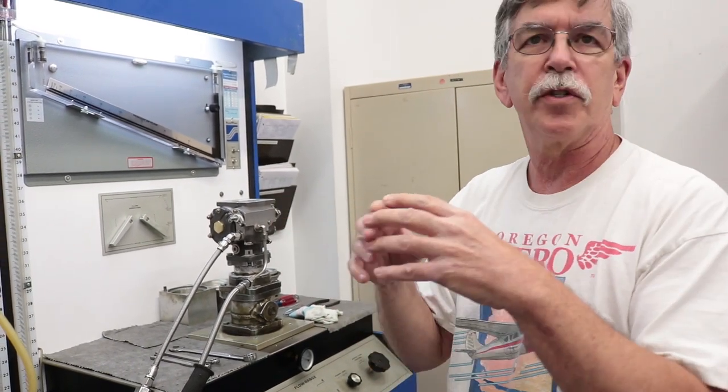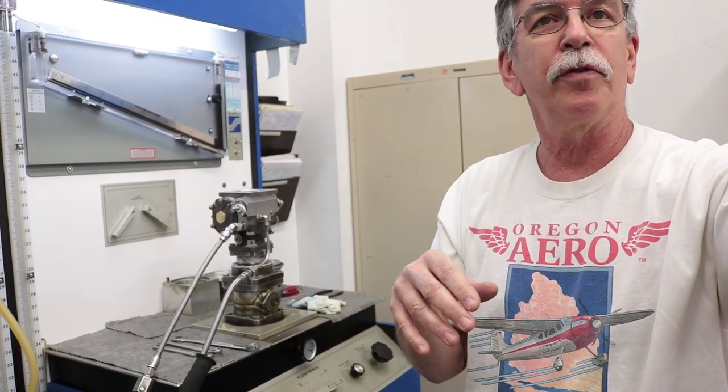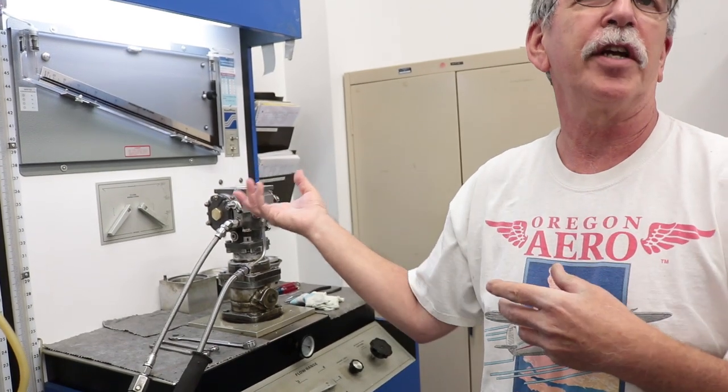You can see the fuel flow here on the flow meter — that's idle flow right now. When you open the throttle the fuel flow increases, and when the air box starts pulling more air through the unit you can see the fuel flow responding. To calibrate internally there are adjustments inside the regulator to change the bottom end of the curve, springs we can change to affect the fuel curve, and adjustments for the top end of the curve, as well as the main jet in the unit.